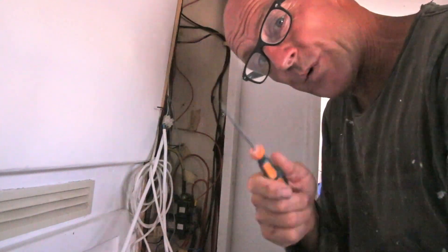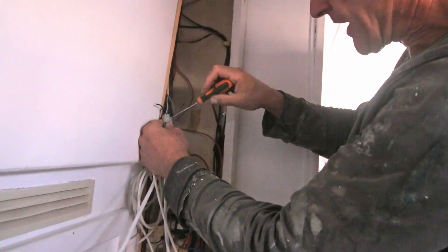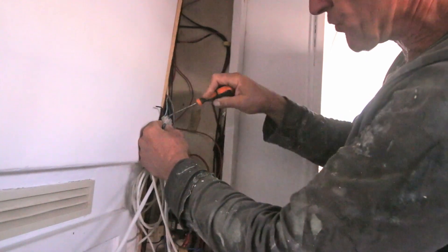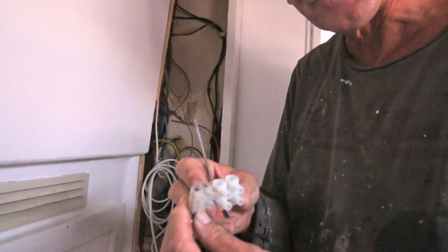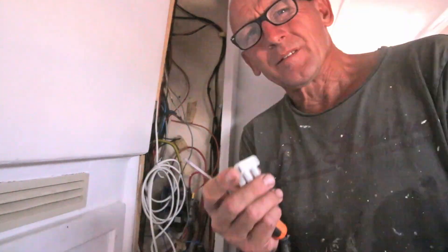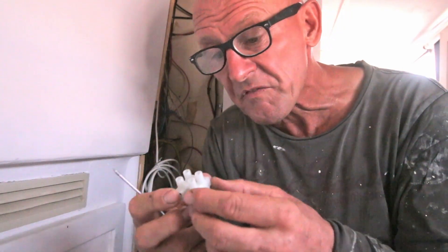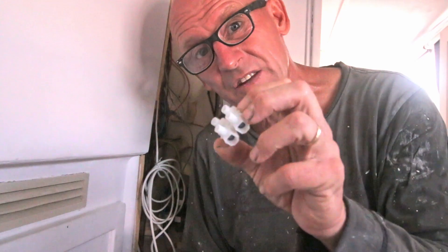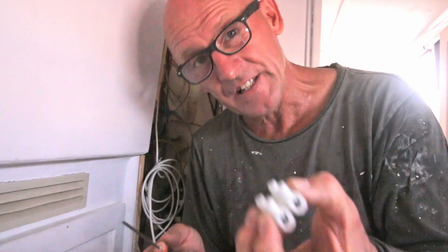By the way, even with 12 volts, switch off the power before you start working on it. 12 volts is not dangerous, but if cables touch each other you have a short. I found a better, bigger fuse block because too many cables already on the little one. Don't get nervous by using this — there will be people seeing this video who think it's crazy, but people used these things for decades. If you do it well and insulate it with tape — it's old-fashioned yes, better solutions exist yes, but they don't have them here.